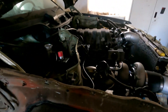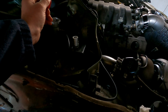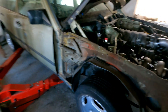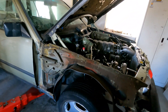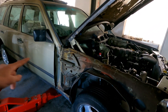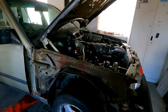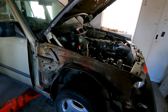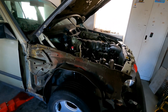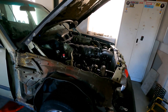The shock absorber here is a hydraulic one coming from an R129. The R129s had an optional feature on the normal versions - except the SL600 where it was standard - to have hydraulic suspension in the front and in the back. The ride height was also adjustable, as well as a sport setting for harder, firmer shocks. I'm using those same shock absorbers on the front and I need to build in the rest of the system.